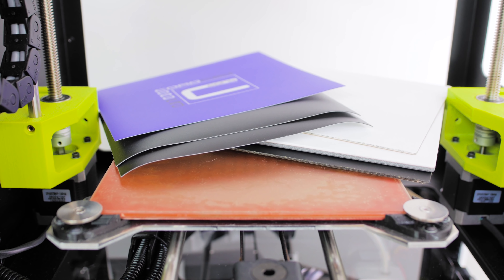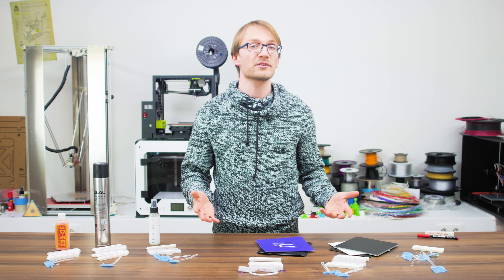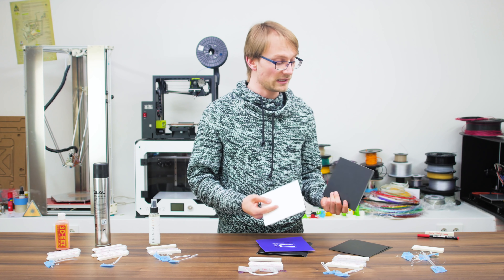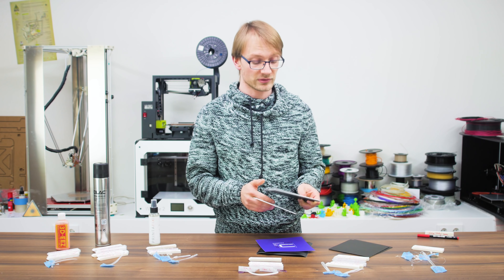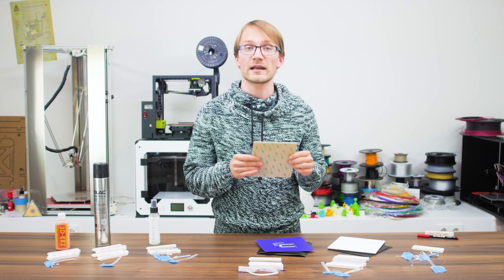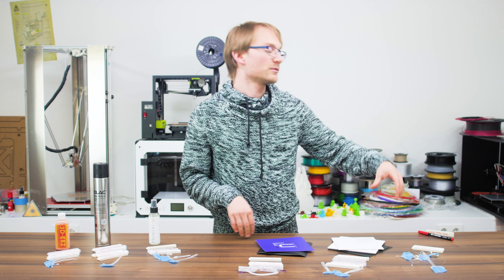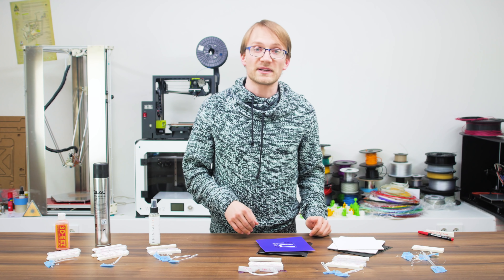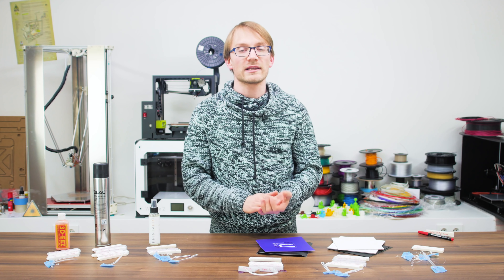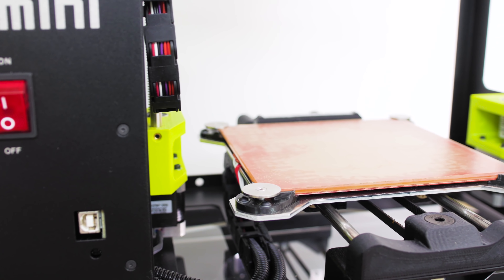And for the solids, I've also got three different types, starting with the Coropad from Poland, a thin adhesive sheet that you could compare to something like BuildTak. Then we've got the American Zebra Plate and the new Zebra Skin, with the Zebra Plate actually being a standalone build surface that you could also clip onto an existing bed, and the Zebra Skin with the same material but as a thinner sheet with 3M adhesive on the back. And lastly, the PEI-coated aluminum plate from Sven Krause from Germany, being a completely standalone bed — he even included a silicone heater with it. You can also get PEI as a sheet or film and stick that to your bed, which is what the Lulzbot Mini uses.